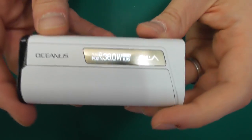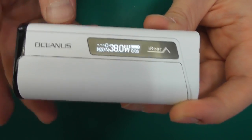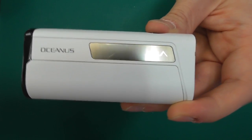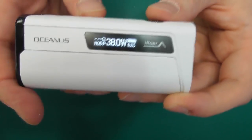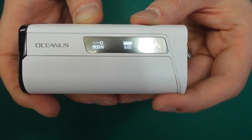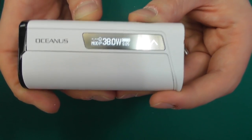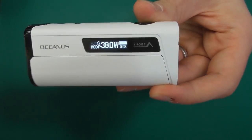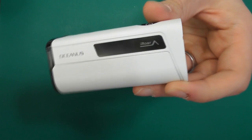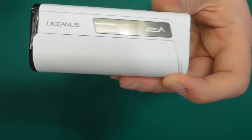In terms of the board: we're in wattage mode — mod N mode here. If we go minus and plus — we're in mod P, which is power mode. So it has normal mode and power mode. From there, plus and fire takes you into voltage mode. Pressing it again: bypass mode. Pressing it again and we're back around to wattage in power mode. There's no TC on this — interesting move by Innokin. The Atheon board's TC has always been fantastic, but they've decided to leave it out. It's just voltage, wattage, and bypass, and you can have powerful wattage or normal wattage — like a hard and soft boost, similar to the EE boards.